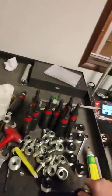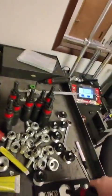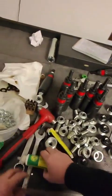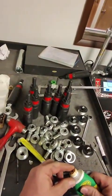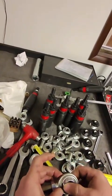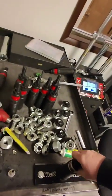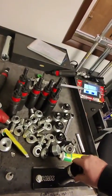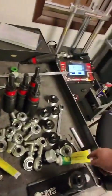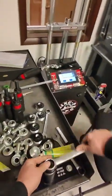Another thing I'm doing here is this extreme pressure lube — it's a phenomenal product to put on all your rod end threads. Don't buy cheap Heim joints — get the good ones with Teflon; these are Teflon Heims, so they're a lot better. See how I just put a little bit right there on the threads — even though that's plated, this will keep it from ever galling up. It's not a whole lot of money and the stuff is amazing.